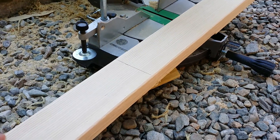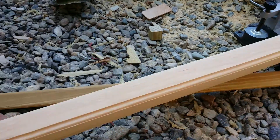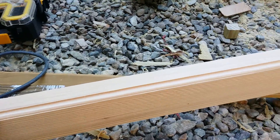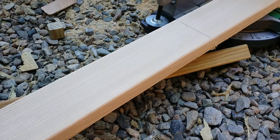If you pre-cut and then do the routering, it's just more difficult that way. So, do your routering first, and then do all your cuts. When you're doing routering, just make two passes instead of one heavy pass — you get a better result.